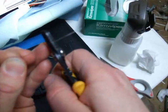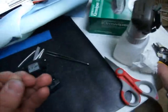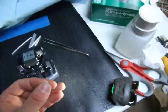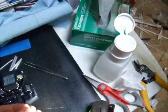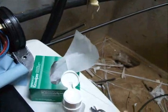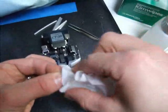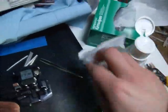There's a very thin buffer tube around this. You can see the bare fiber there with scraps. A little alcohol — clean it off until it squeaks, and you're sure that every bit of dirt is off it.